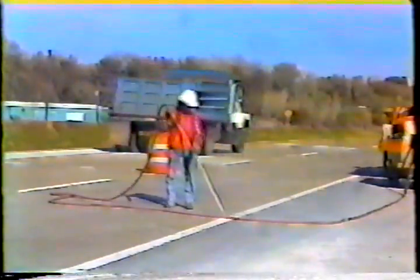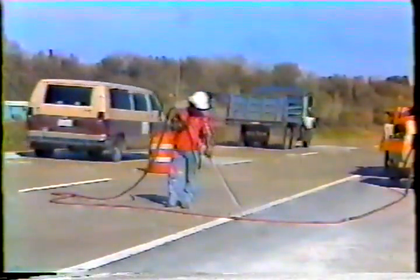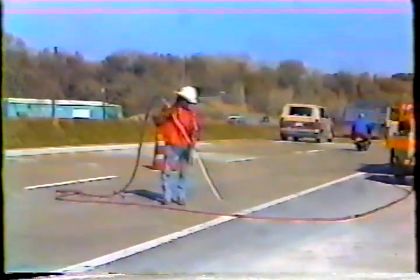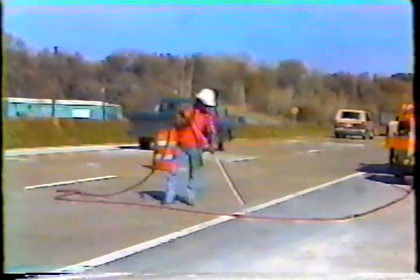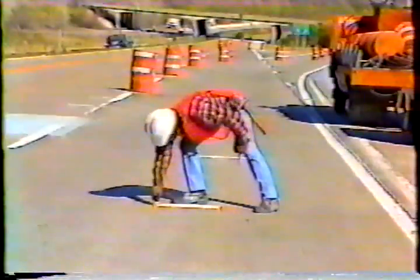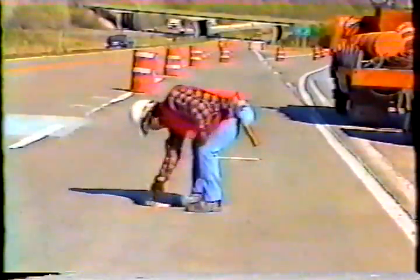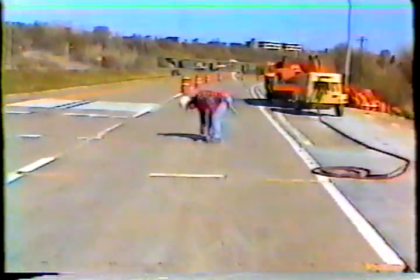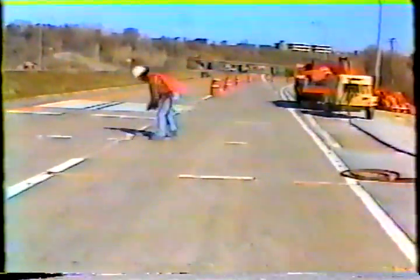As you know, if there's any dust, the new concrete won't adhere to the old. The first step in the cleaning process is air blasting. This removes most of the loose material left in the spall. After cleaning the spall with the air blast, take a screwdriver and clean out the debris left in the saw cut. If any material is left in the saw cuts, the repair won't be effective, and a new spall will soon appear, making your work now a big waste of time.